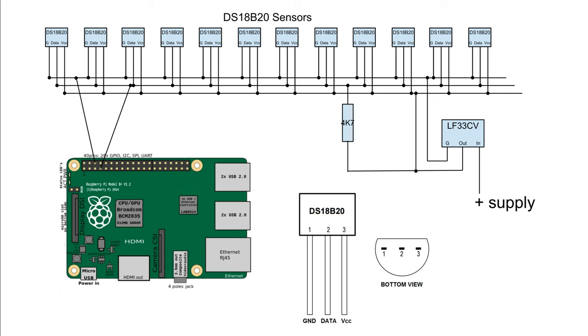To find these, go to sys/bus/w1/devices, and you'll see a list of folders, the names of which correspond to the serial numbers of the temperature sensors. There'll be one folder for each sensor, but the read process is quite slow, so it may take a second or two before they all appear.